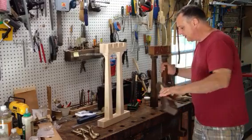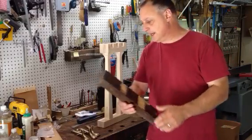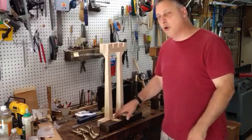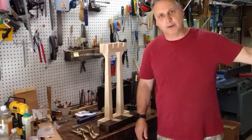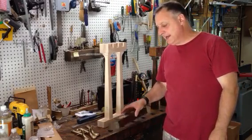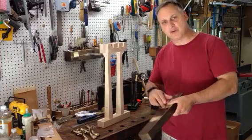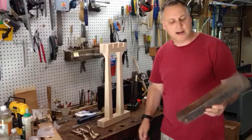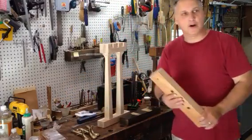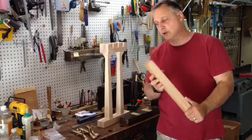I want to show you the base — this is very important. This base right here is a lot larger than the one from the manufacturer, and the smaller one will not fit properly on the underside of the piano. I need the larger size and I really don't want to use the old wood. That can be done, but I chose not to. So I used some spare pin block material — it's very good laminated beech hardwood.